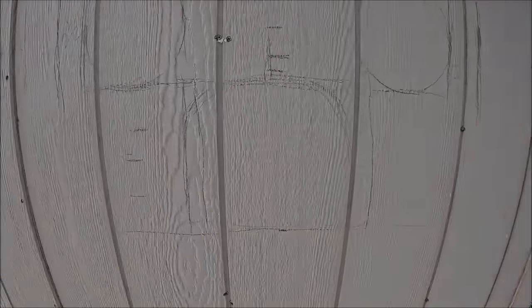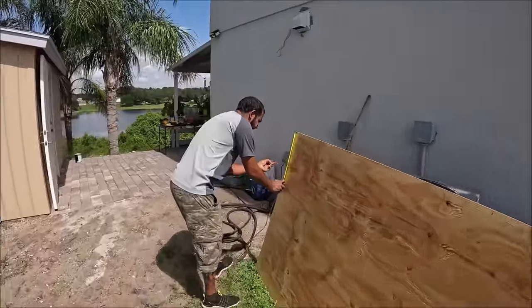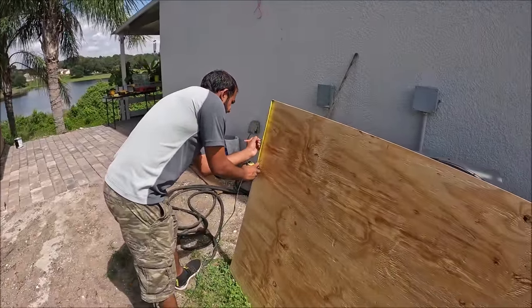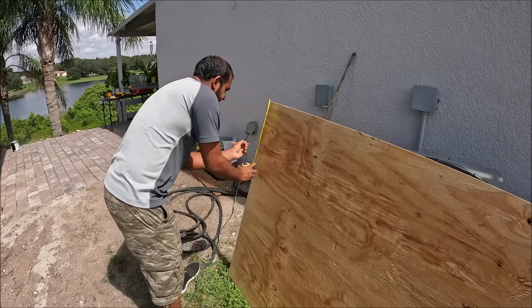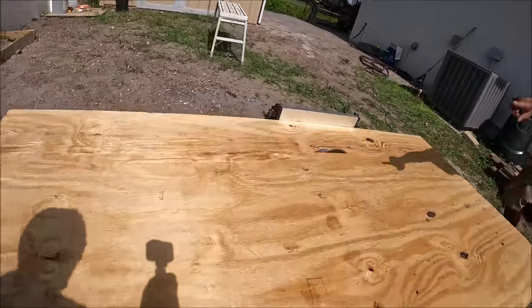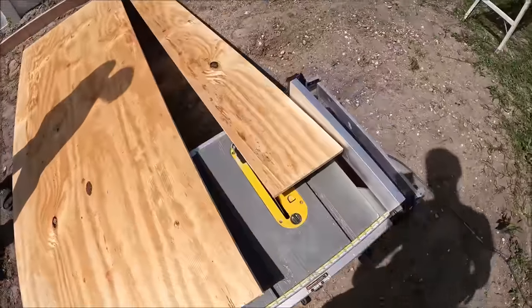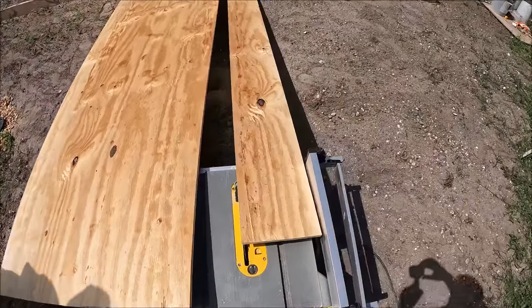Here's the measurement — you can see this is the mouth, the two hole. I'm going to start ripping the ply and explain as I go. I'm going to build the inside structure first, then the outside structure, and show you how to build the mouth. I'm going to rip the ply now to build the inside at nine and a half inches height, making the measurement here.